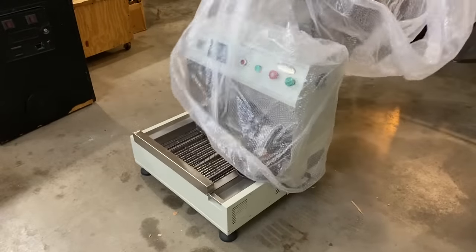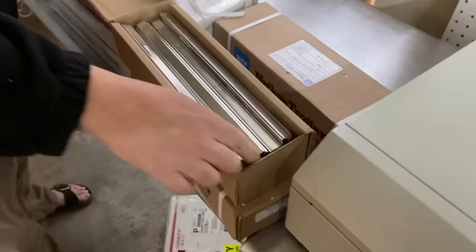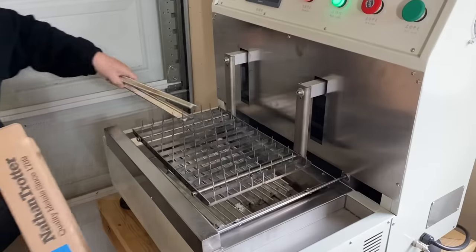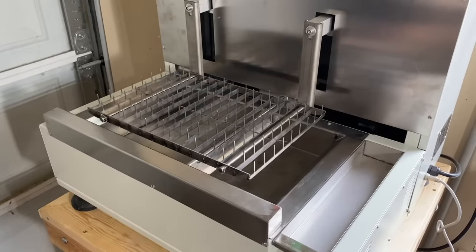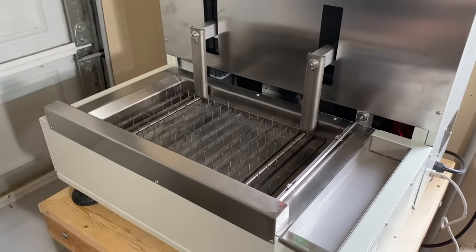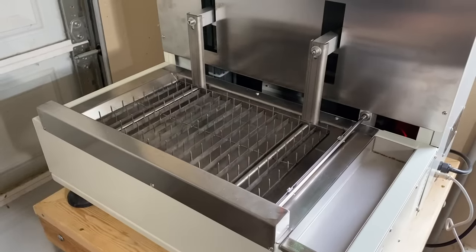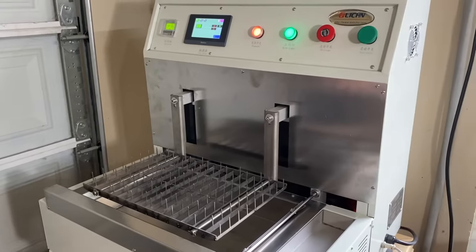This is a solder dipping station, and here's the solder for it. So apparently if you're serious about soldering, you buy your solder in bars. Which, by the way, the solder alone in this sort of quantity was several thousand dollars. So the way this thing works in theory is that you fill this tub with solder, you put your board on top, and as you can see it will lower the board into the solder and back out, which should solder all of the points on the bottom. Well, we also had to run 240 volts from the breaker box to power this thing, but anyway,